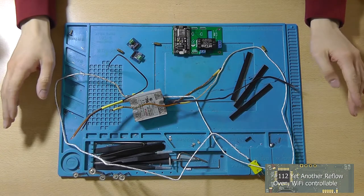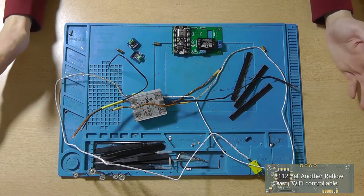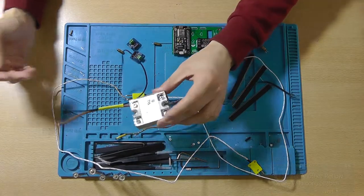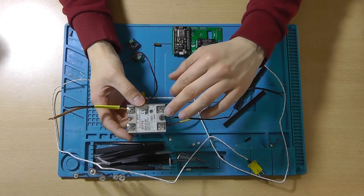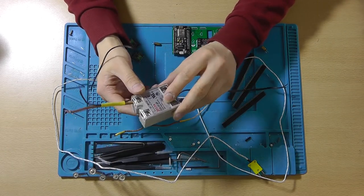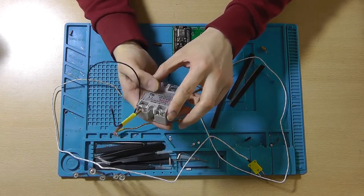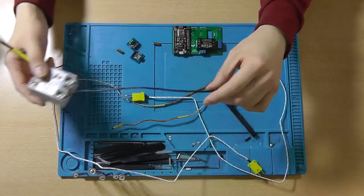Now in this video I will be showing you how to build yet another reflow oven. There are obviously a couple of things you'll need. To begin with, we need a solid state relay that's controlled with a DC signal. Now I'll put a link to this in the description. This is the 25 amps module, which should be plenty of current to handle our reflow oven.